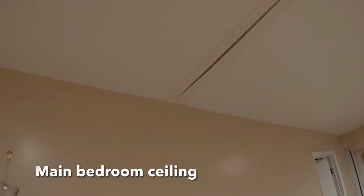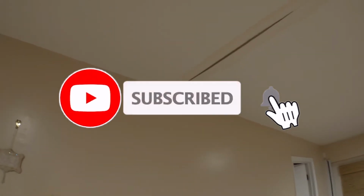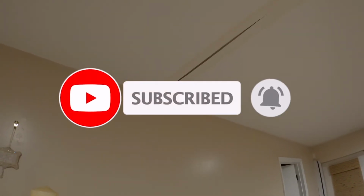This is the last of my repairs. This is a leak from a chimney crown that was cracked. So water was running down through the crack, down through the flue, from the top floor down to the main floor, and then it ran across the firebox in the chimney upstairs, and the water came out here.